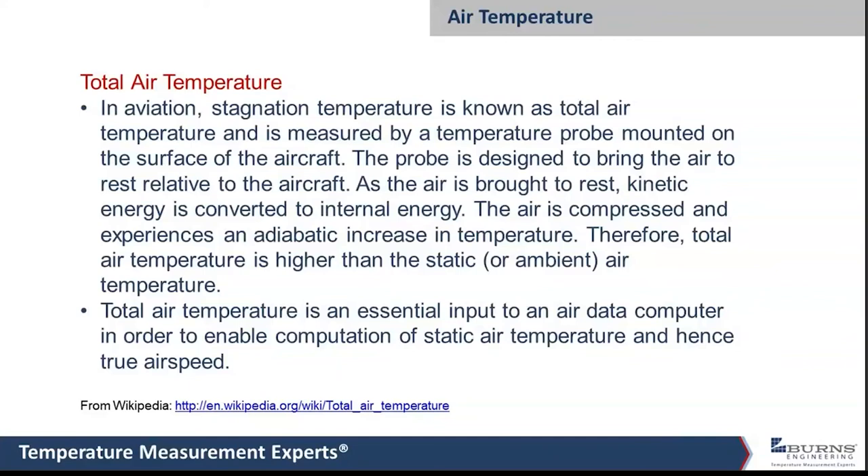Question: is there any minimum length of RTD inside the freezer or autoclave that allows for higher accuracy? No — in both of those applications, the whole probe is completely immersed into the environment. We offer different length probes for those applications, but it's typically to accommodate mounting considerations or calibration requirements where the probe needs to be dropped into calibration equipment for testing.